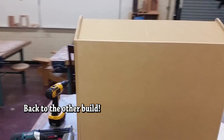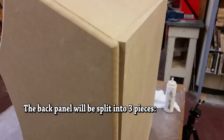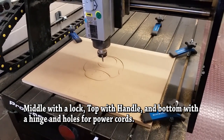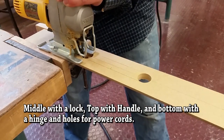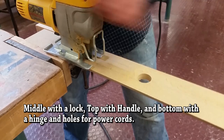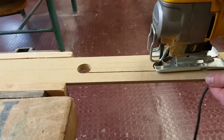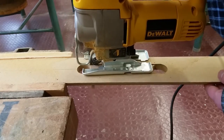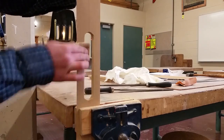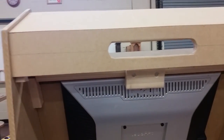For the back side I start with one giant piece — it's just easier to cut it out originally rather than ripping it three times afterwards. The very back piece I used our CNC router, carving a big mushroom in the back — you'll see me painting that later. The very top piece I make a little handle so it's really easy to carry the cabinet when it's done. When finished I'd say it's probably about 40 to 50 pounds. Smooth it out since I'll be using my hands to carry this — I don't want any jagged edges cutting me open.